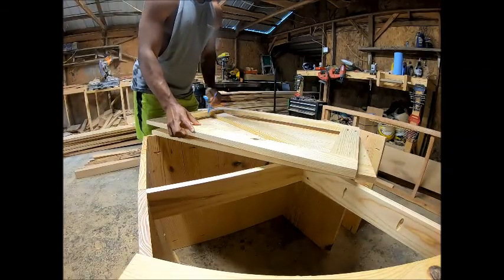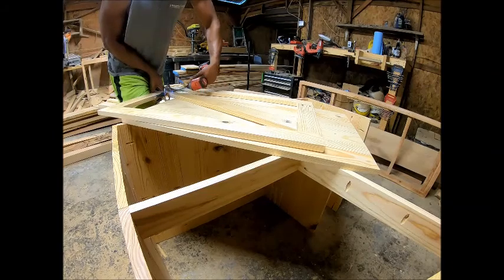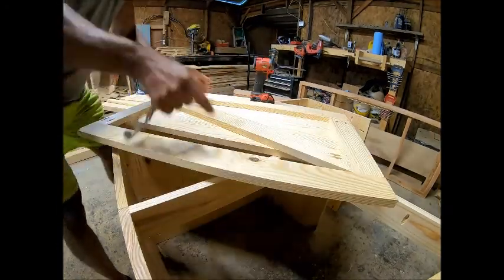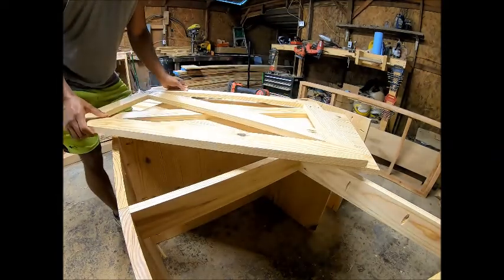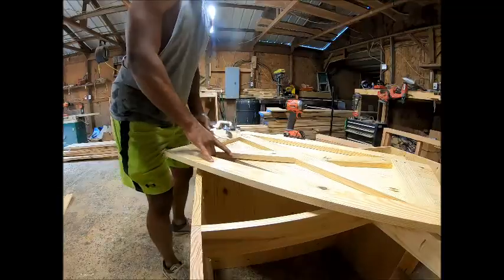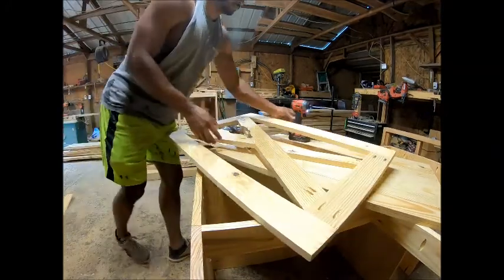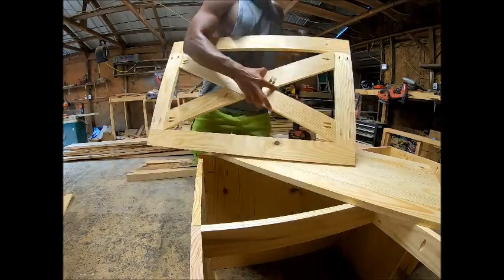It's as simple as that — there's no reason to try to find an angle. I'm an engineer and I don't bother finding angles; just do it the simplest way. Pocket holes top and bottom — same concept for the other side, except you'll have the middle to cut out. Always draw a little line to mark the top and the bottom, then a little squiggle just so you know which was top and which was bottom. More pocket holes to make the X — same exact concept applies to the drawer faces, just with different dimensions.